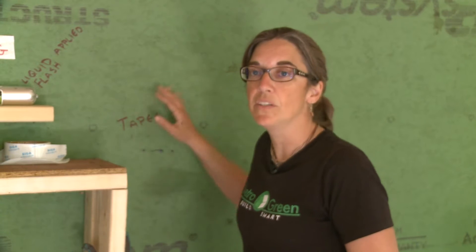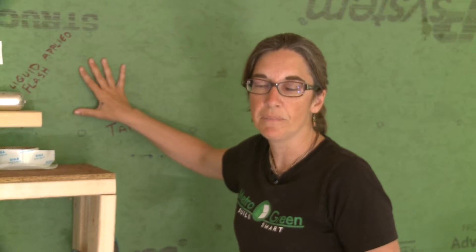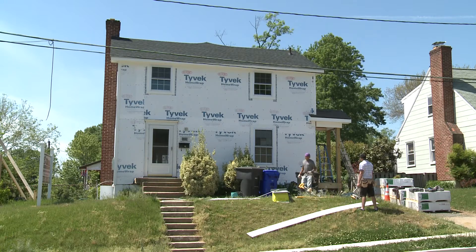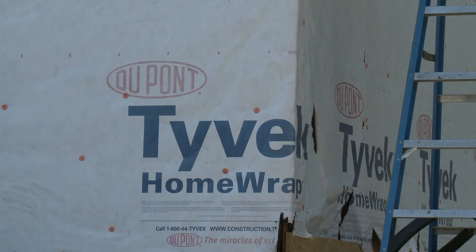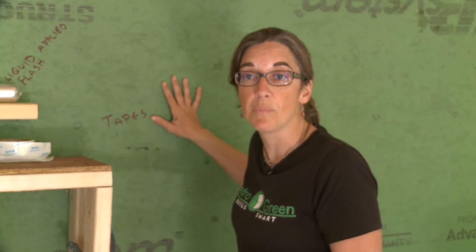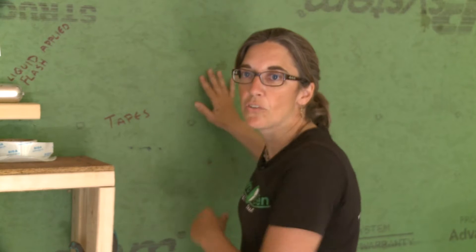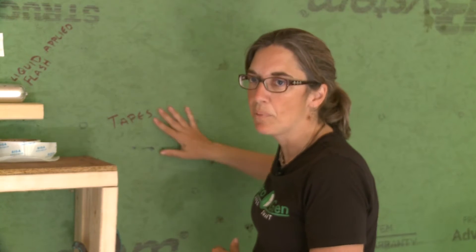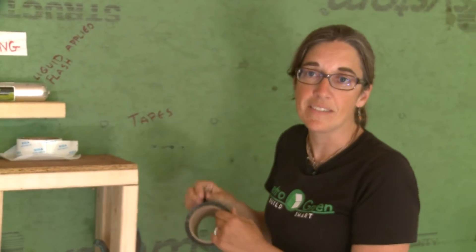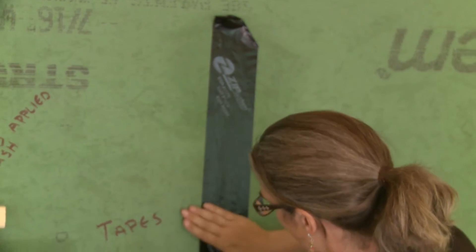On this particular building, we're using a product called ZipWall, which is this large green product we see here in front of you. There's a product called building paper — you'll see that's white and it's on houses. The difference with this product is that it is adhered to the plywood before it comes to the site. So what we do is we put the building up — this is structural plywood like any house, but with that membrane attached to it. We put this up and then all we do is tape over those seams. Once we do that, we've got an airtight building.